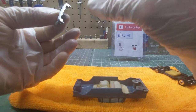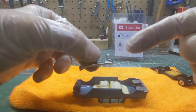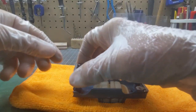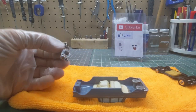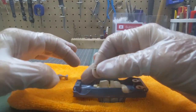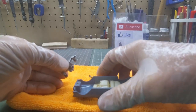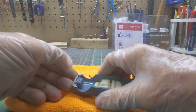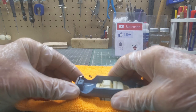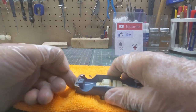And then the front. Now all I did to the front and rear bumper was polish it, but on the front headlights, I put a little flat aluminum paint on the headlights, kind of give them a look like realistic like. Now, on the original, it had a screw that went in this hole right here that screwed into this grill. So I'm not going to use that. What I'm going to do is I'm going to put this grill in here, and when I put my screw in the front, that will be like a set screw, and it will hold it in place because it does push back on it a little bit. You know, you can push it in some.